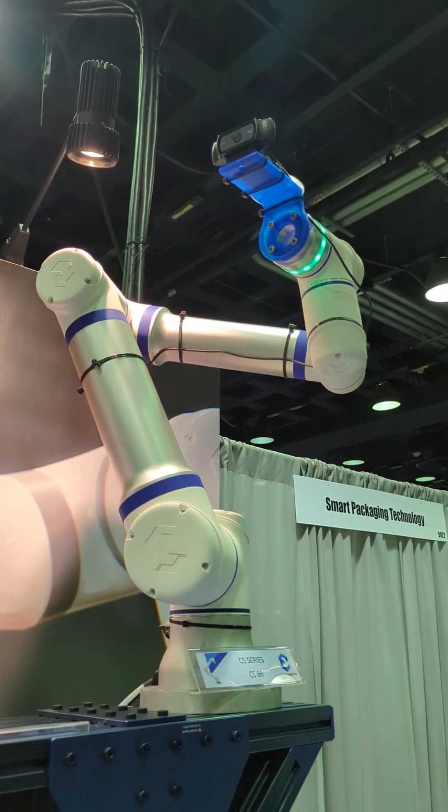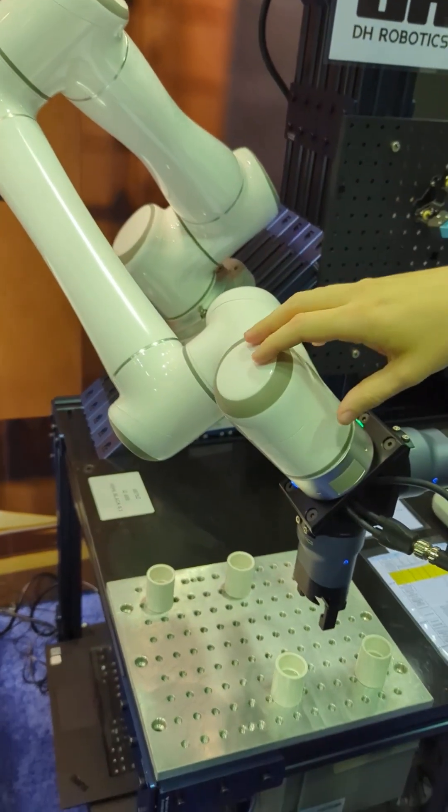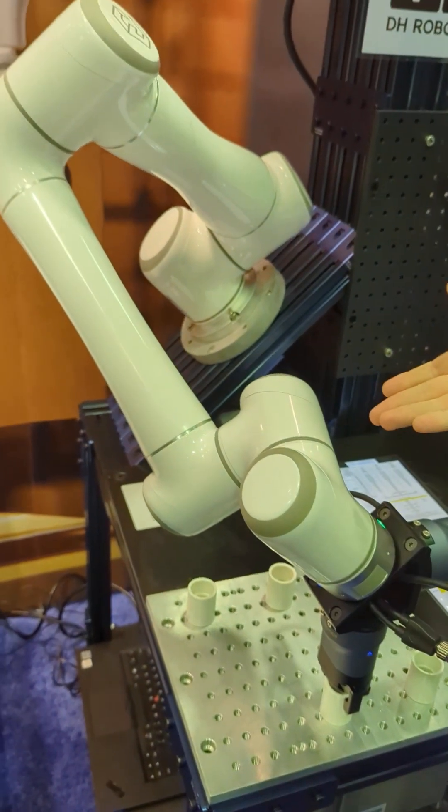If you have big chunks of metal at the end of your robot tooling, you really need to be designing and engineering with plastics, so that way they either break if they hit a human or they don't cause any type of cuts or lacerations. That's something you definitely have to keep in mind.